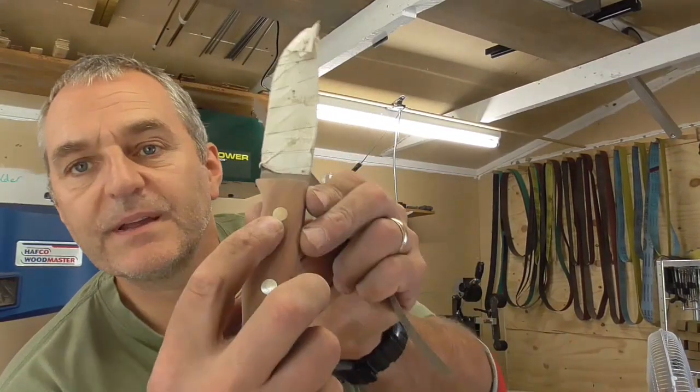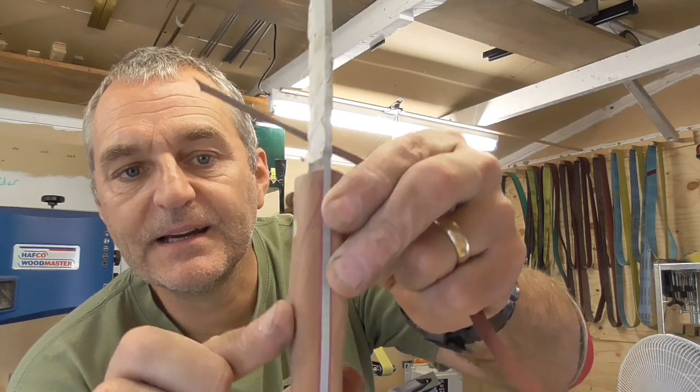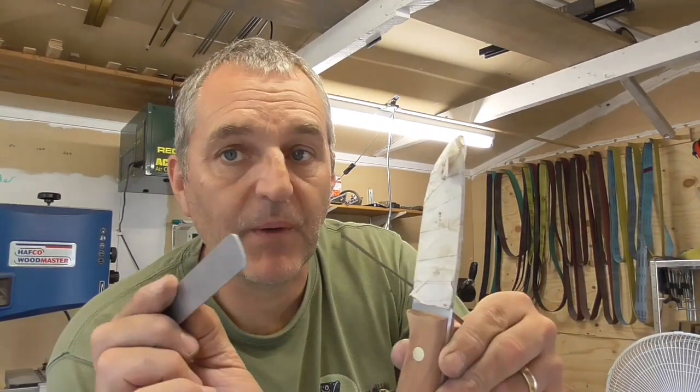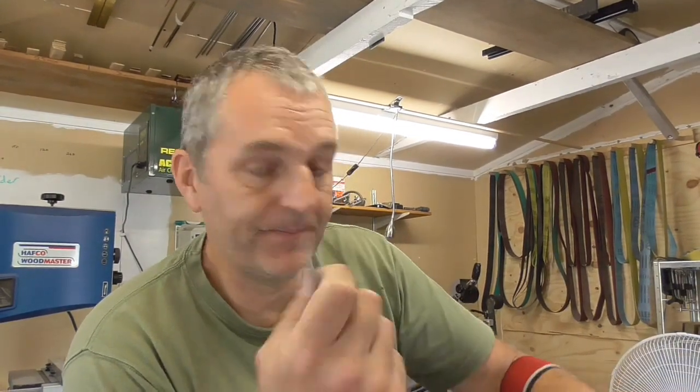Also with that, I can use it where you've got your bolts, whether they're Loveless, Corby's, pins, mosaics, whatever. The way to keep those nice and flat and stop them becoming prouder and prouder, because obviously they wear slower than the wood, is to use your little piece of metal with your sandpaper, get it nice and flat, and keep doing it. But only do about, say, 5 or 6 rubs, take it off, blow it off, because you'll take the metal off of there. And if you keep going, it'll drive black dust from the metal into the wood, and then it's a pain in the ass to get out. So literally just 5 or 6, or 4 or 5 if it's softer wood or darker wood, take it off, blow it away, keep it clean, and keep on going. Otherwise you end up with a right mess. I know, I found out.